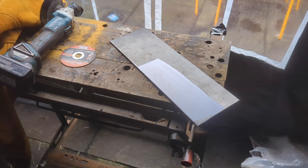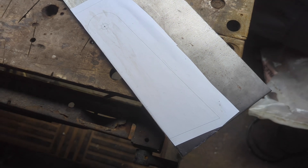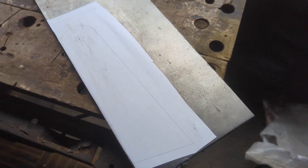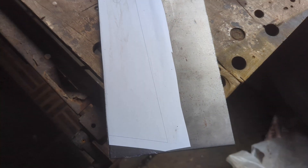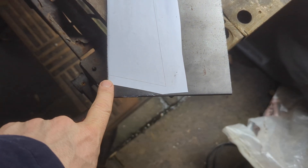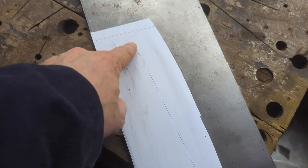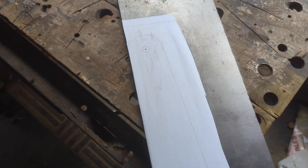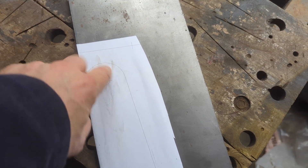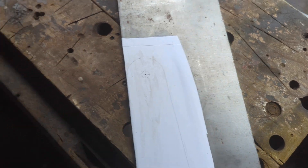Working in the gazebo because the weather is miserable as ever. I've got my pattern glued down to my sheet of metal — this is the same 6mm stuff I used for the rest of the motor mount. The plan is to just run a grinder up here. I'm going to leave this gap here so I've got some extra material to work with, and then I'll roughly trim this and use the bench grinder to try and get a nice smooth end to that.